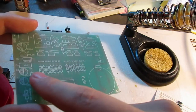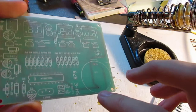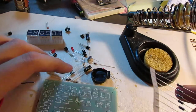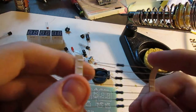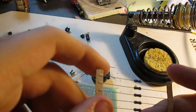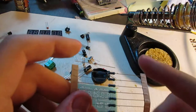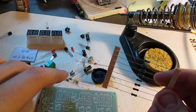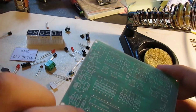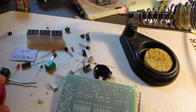So in this case, that would be all of these resistors and probably some others around here somewhere, but unfortunately I haven't quite learned the resistor color code yet, and worse still, these look like brown, black, black, and then purple. I can't remember what purple means, but brown is 1 and black is 0, so there are a lot of 1 and something resistors, but the circuit board only calls for a couple over there, so apparently I'm gonna have to look at the manual.